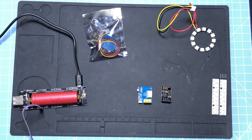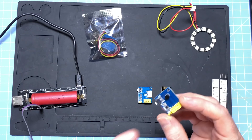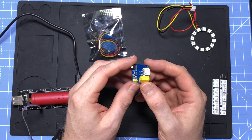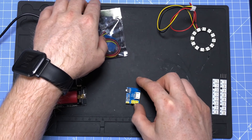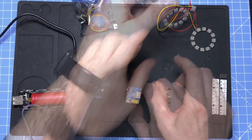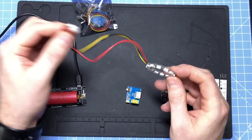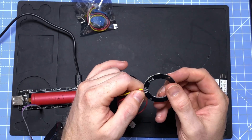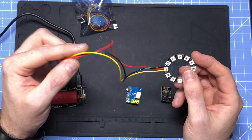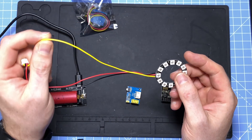As I touched on in one of my earlier videos, I had another of these modules similar to the temperature one we used last time. This one is an RGB LED controller. In the package you get the board and a small three-pin wire, which I've hooked up here. These basically connect to anything based on the WS2812B standard, so you've got VCC, ground, and one wire for control and signaling.